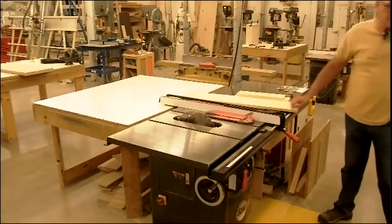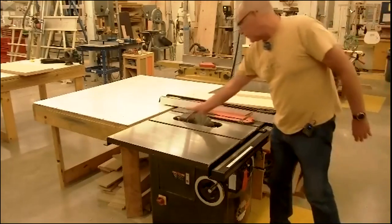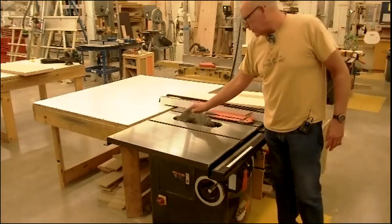It's a 10-inch cabinet saw, so that's a 10-inch diameter blade and a 5¼ horsepower saw. Really the only thing that means to you is that if a board were to kick back out of this machine, it's going to kick back really fast — 60, 70 miles an hour out the back. But we have safety measures in place. One of the most important is what's called a riving knife — this little guy right here. I'll show you what that does in a little bit.